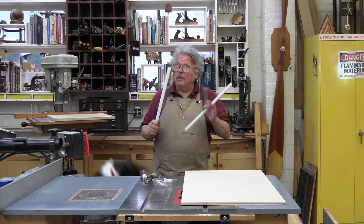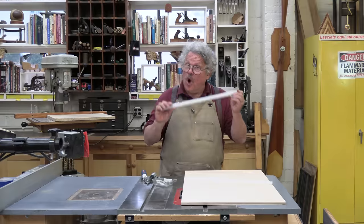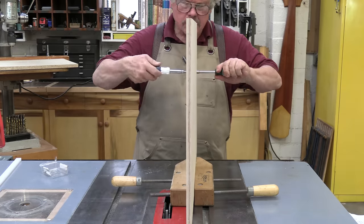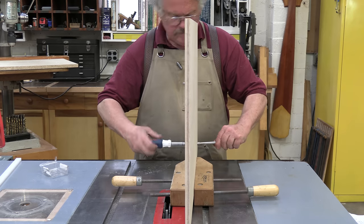While you're set up on the drill press, make both guide bars, even though we're going to mount just one. Bolt the bar in the dado and snug up the machine screws. Not too tight. We don't want the plastic to expand yet.